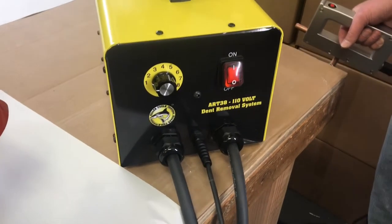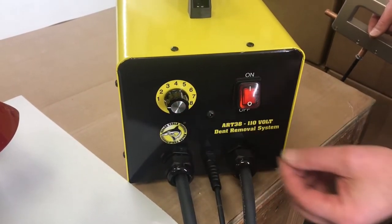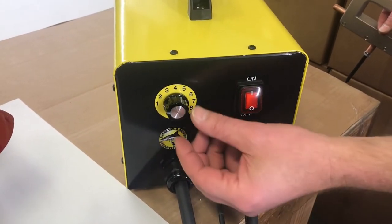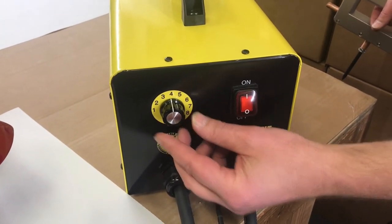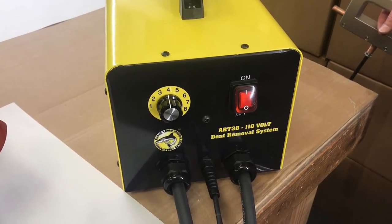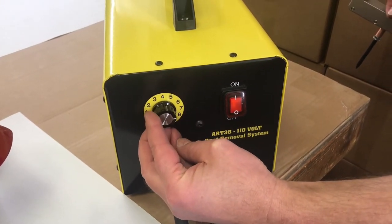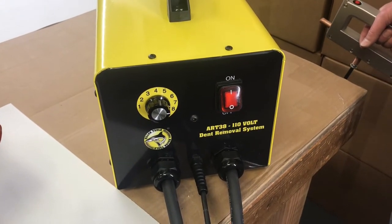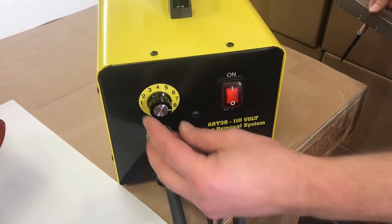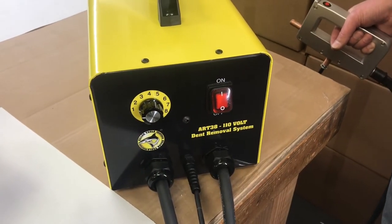The settings for use when welding would typically be one for general welding and dent pulling. The electrode setting should be between three to four when doing wiggle wire or keys, and up to eight when doing shrinking. You can also shrink at two or one — it's your preference — but one is the best setting to use when welding for pulling dents.